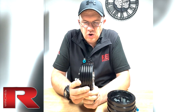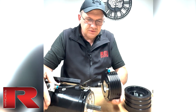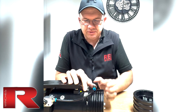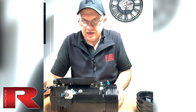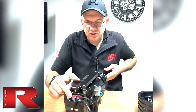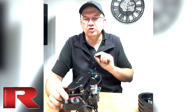This is an air brake. It works in conjunction with the motor — if we grab a motor, it would fit onto our motor like so. On our winches, you have power for your solenoid coming in here to tell the winch to winch in or winch out. As well as being connected to the terminals on your solenoid on the back of the winch, we've also got it connected to this air solenoid. Every time we give the winch a signal to winch in or winch out, it activates the air brake to release.